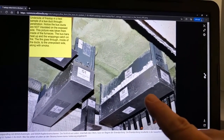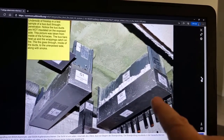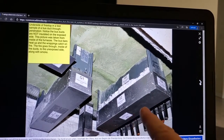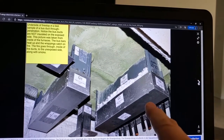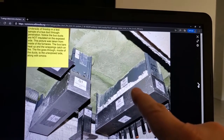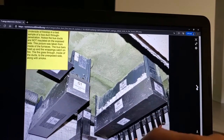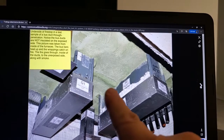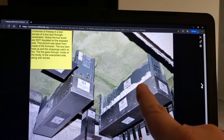And notice how the bottom of this is capped, right? Usually pipes you can cap more easily, just fasten a cap on. In this case here, it's a sheet metal cap and it's stuffed with ceramic fiber, because the bus duct itself has issues, right? Like this is held with plastic and so forth on the inside, so this whole thing on the inside could possibly come crashing through and down, which almost happened here. But here's the fire stop mortar, and here are the 2 bus duct.